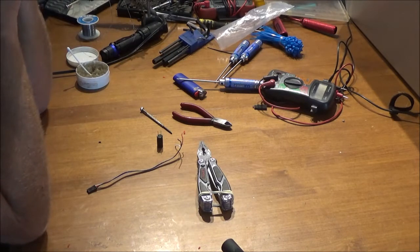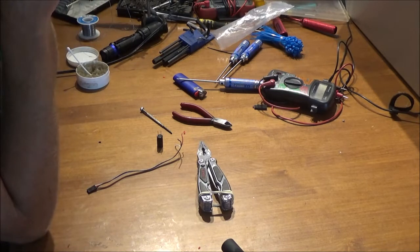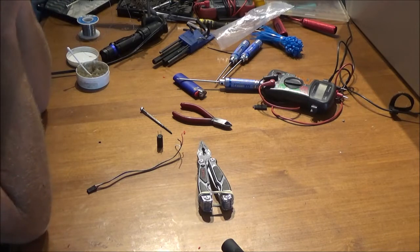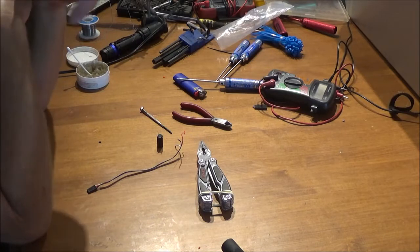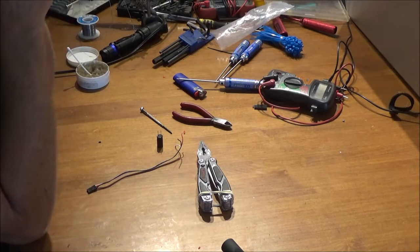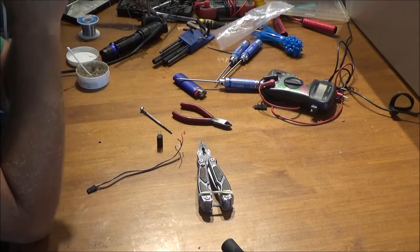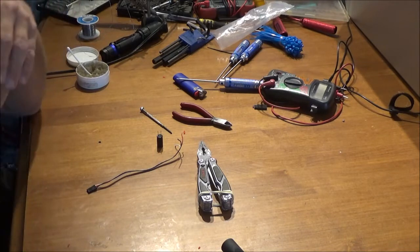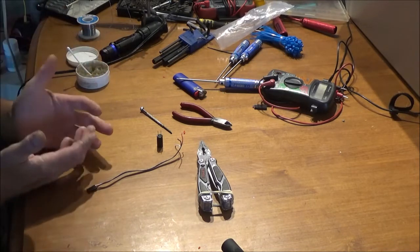There's a lot of mixed information on the internet about whether the EVX2 ESC is a 1 amp or 2.5 amp. I tried installing a BEC — actually two different types: one was a 7 amp just below 6 volts, and the other was a 3 amp at 6 volts switchable between 6 and 5. Either one was really screwing up the system. The servos with the stock ESC setup were still glitching out — brownouts, where your receiver goes on and off. It could be from hitting the throttle or steering; in this case steering was causing it.